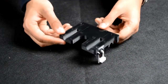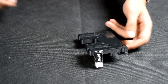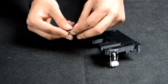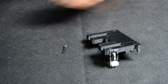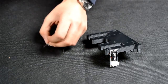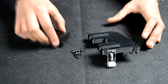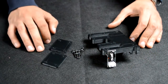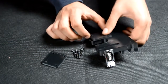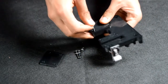Next, you want to take the 3D printed X motor carriage assembly from the previous step. Take an M3 by 22mm bolt, slide an M3 shake proof washer onto it, and you want to do that for three more bolts so that you have four in total. Take the two 3D printed X motor carriage clamps and lay them on top of the carriage like so,